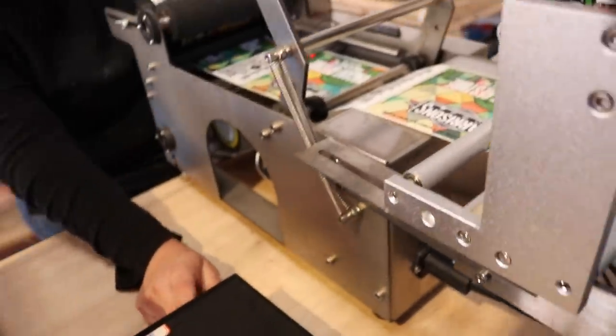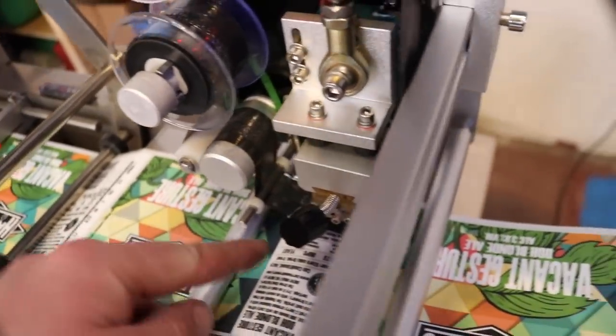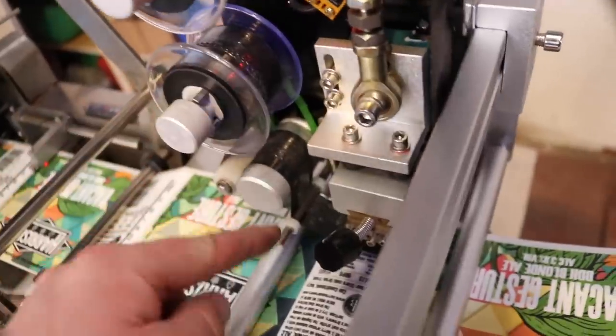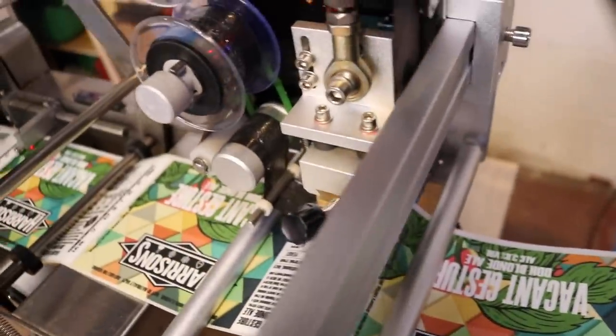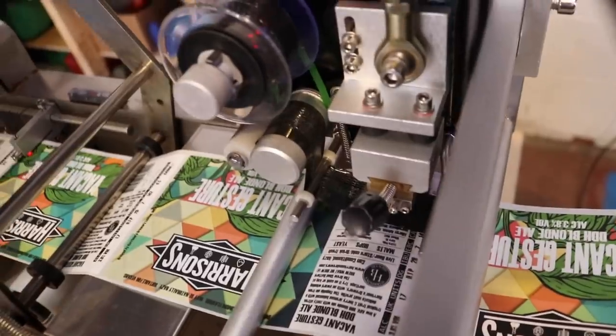The numbers are starting to fade — can I turn it up by about five degrees or so? This heated section here heats up and stamps the date through this waxed paper. But if you get it too hot — watch — there we go — it burns straight through the paper, so it's a case of fine-tuning.